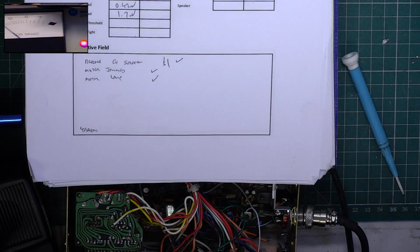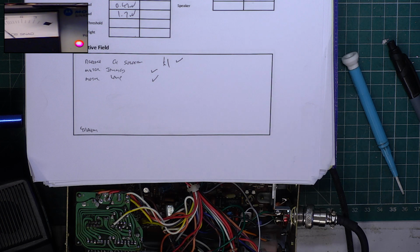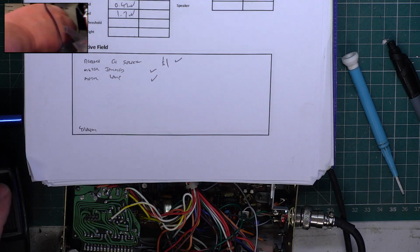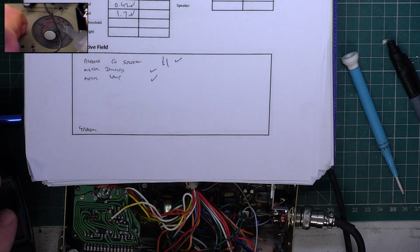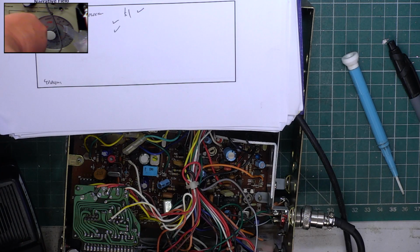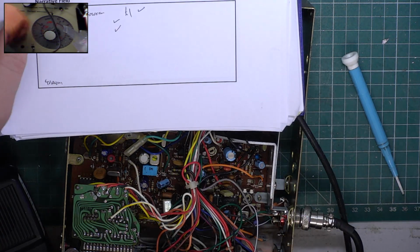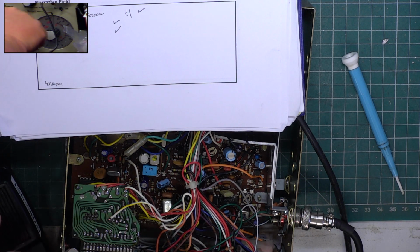Squelch. It's on the attenuator. So I want 100 microvolts for full squelch. So that's 10 microvolts, 30 microvolts, 100 microvolts. It's coming in at 300 microvolts. And for minimum, pull that to standby, turn the squelch down, set threshold, signal generator back on.